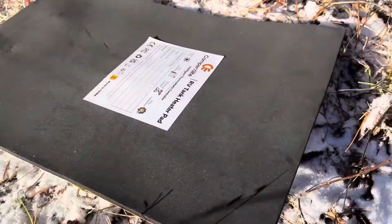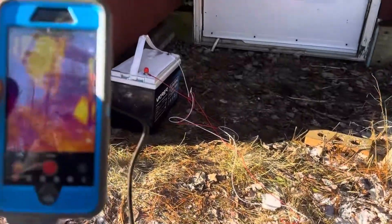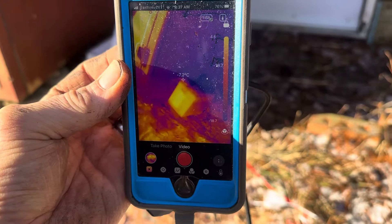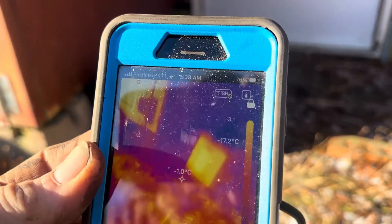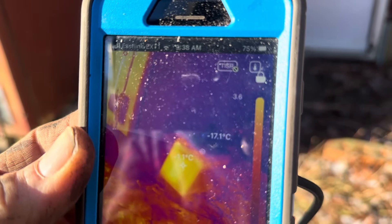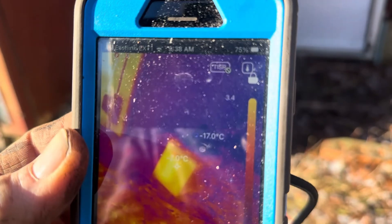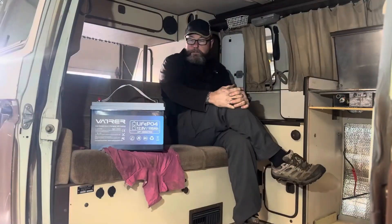I've got this small RV heating pad — the kind you'd put underneath your RV tanks to keep your water and black water from freezing. You can see the red — that's the case of the battery. We're at minus 2.3, minus one. It's minus 17 to the right of the battery and only minus one right at the battery, so it's definitely warming up. You can see the heat signature, the color change. The death of these batteries is trying to charge them when they're cold, but if you can keep this warm with the self-heating, it passes the test.